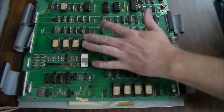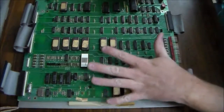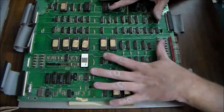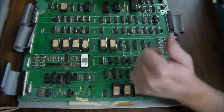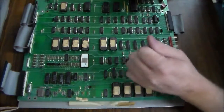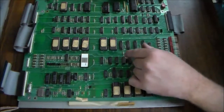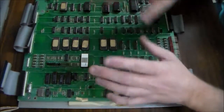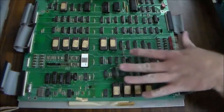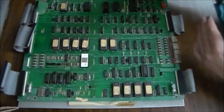So you can see the way this thing was designed, it's kind of like three big, huge boards. So they basically just made a really big board and then split it into three and folded it on itself. And then remember from the pictures of the inside, this isn't even everything. This is just the actual gameplay. All of the little accessory stuff, like the audio amp, the little board that can tell where you're, you know, the position board for the steering, the other soundboard that makes the Peter Gunn theme song, the power supply, the power brick. There's another little lamp driver board that makes the lamps work on the display. There's all that stuff too. So that would be, you know, another couple of these boards. So basically, they designed a really long circuit and then broke it up into boards and flipped them in half.